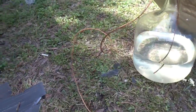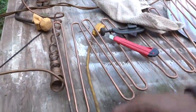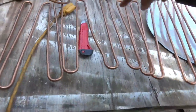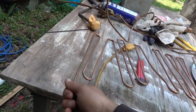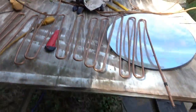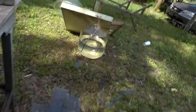I'm going to explain why sand is not a bad option, but if you have a really long piece of tube — imagine if this was filled with sand — you kind of have to pack it in when you bend it. Some people will say you just take an air compressor and blow it out, but if you really think a bunch of sand is going to blow out all the way through, it's just going to get plugged somewhere and it's pretty difficult. Salt — the idea is you can put salt in there and submerge it in water so the salt dissolves. The problem is I've done that before and ended up with a glob of rock salt in there that pretty much never came out. So for short pieces it'll work. Wider tube — like half-inch diameter or even three-quarters — it'd probably work, but for thinner tube it's just not really an option.